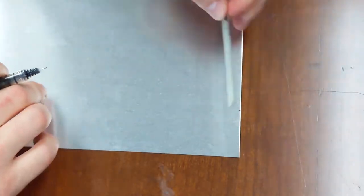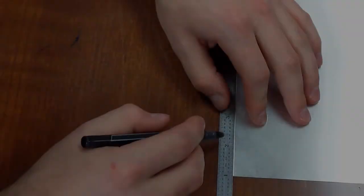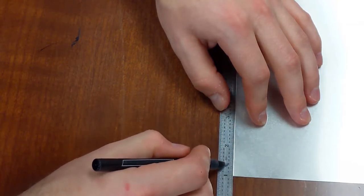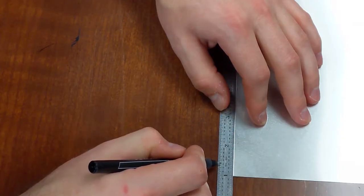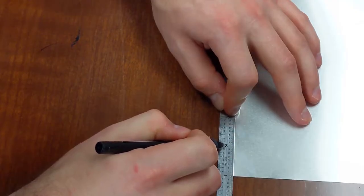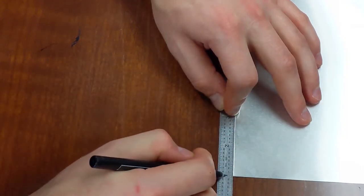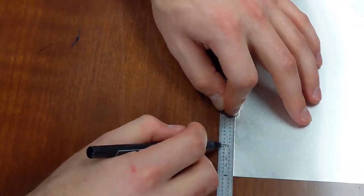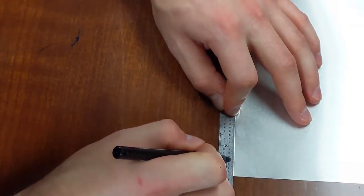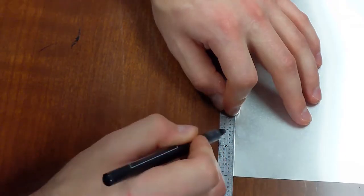Repeat the process on the other side. Note that the numbers are larger on one side because that side is 64ths of an inch, while the other is 32nds. So instead of 2 and 20 ticks, it will be 2 and 40 tick marks. Remember, I burned an inch over here, so the 2 is really a 1. Where my mark needs to be is at 1 inch and 5 eighths, which on this setup will be at 2 and 40 ticks.